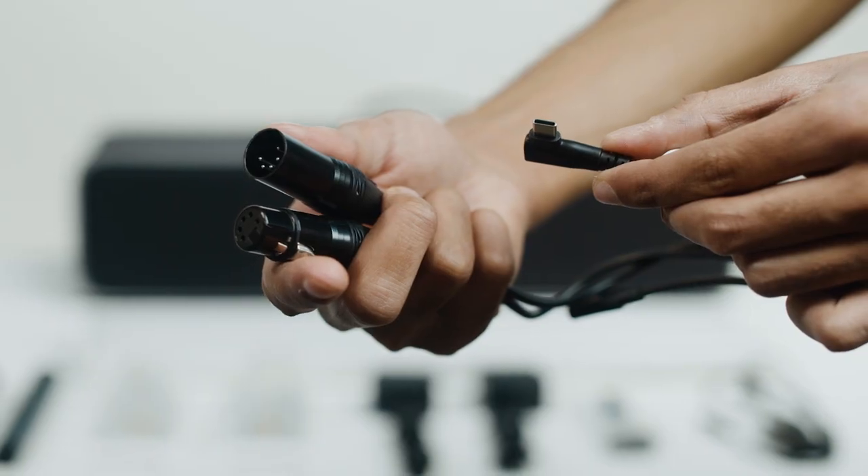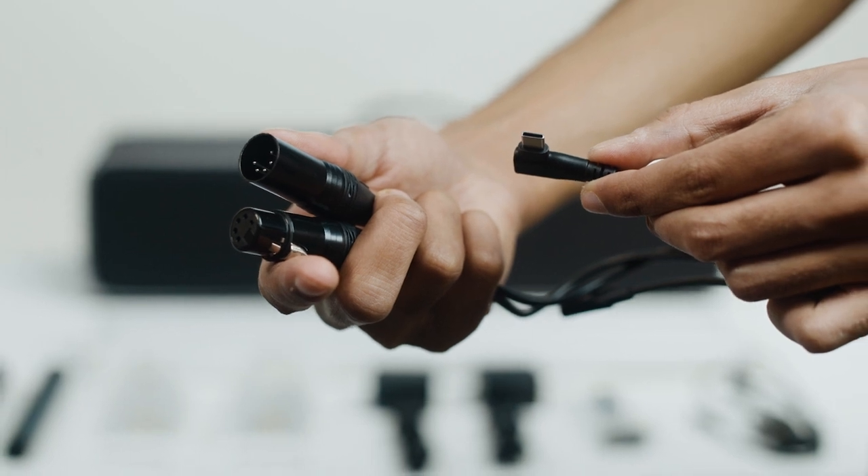In addition to wireless Bluetooth connectivity, users who want to operate the Pixel Tubes with a DMX console can control them using our special USB-C to 5-pin DMX 512 adapter. The Pixel Tubes come with 10 built-in DMX profiles, DMX loss behaviors, and customizable DMX addresses, all of which can be accessed in the menu under the DMX settings. You can find the DMX charts for these lights on our website.